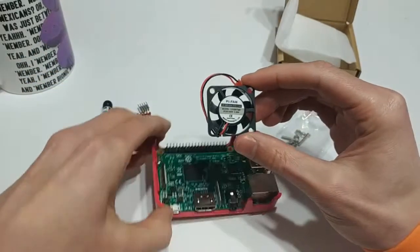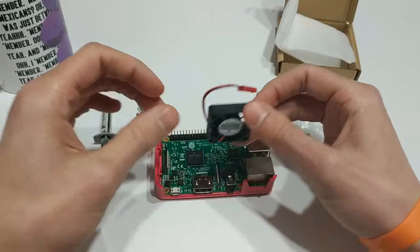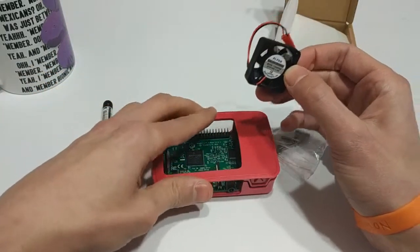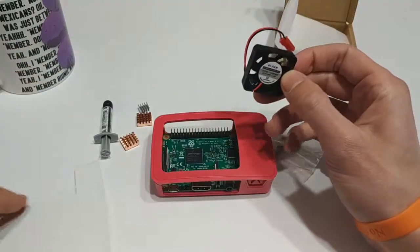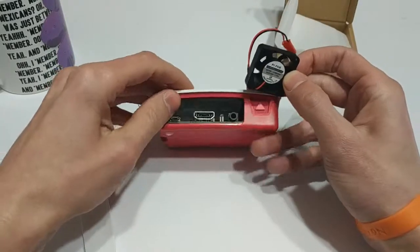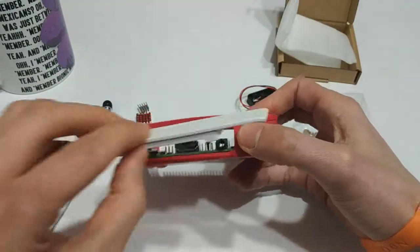The principle behind fans is that this whole board is going to be generating heat, and it's better to have the air circulating around rather than let it sit there, especially when you have a case on it. The Raspberry Pi official case kind of clips on like this. You don't have to have the top bit or the sides on it, which is really handy. Because if you put the top and sides on, obviously there's no place for the heat to escape — all this hot air gets stuck in there. It's the same sort of principle as using any PC with a case.